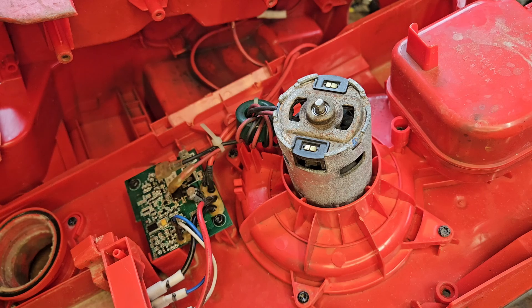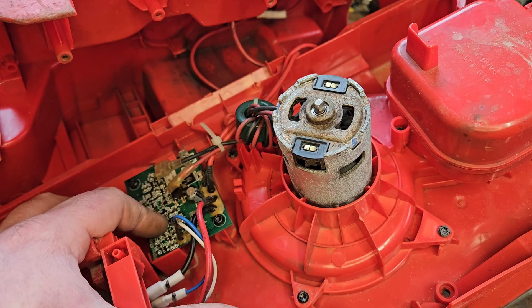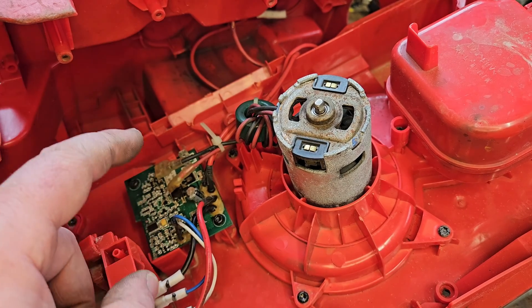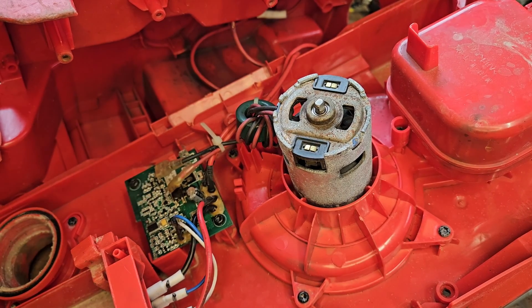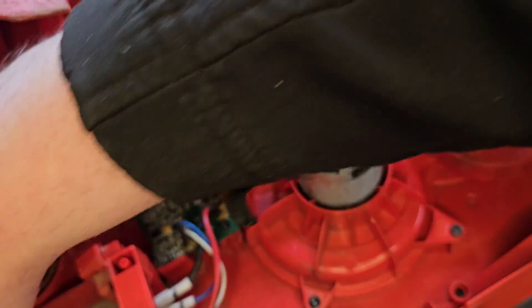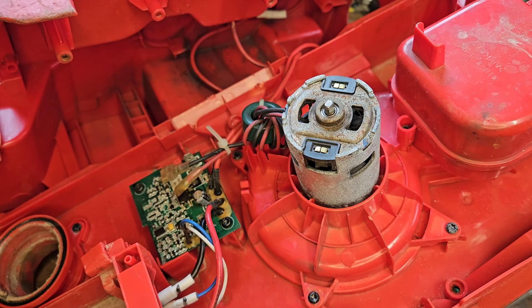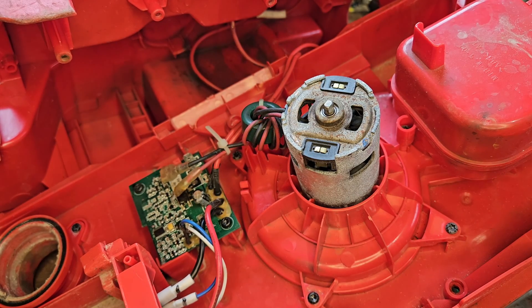Can we do anything with it? Well, I'm willing to try. The problem is we could probably bypass the board and get a switch, but bypassing the board would have its issues. The main issue I'd be concerned about is low voltage cutoff for the batteries — it can over-discharge them and then they won't charge on your charger, and you'd have to boost the voltage with another battery. You don't want to be doing that all the time.